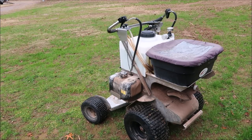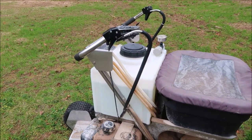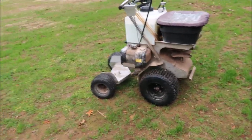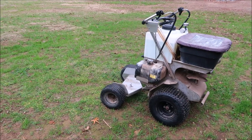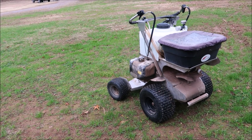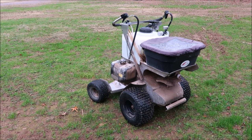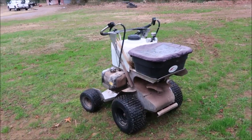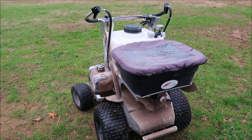I'll use my spray tank when I'm blanketing the yard with a pre-emergent or post-emergent application. This one not having agitation is going to be a little bit more difficult to keep stuff mixed up properly when you're mixing multiple products in the tank. There are other machines out there — Ferris just came out with a new one, Scag came out with a new ride-on spreader sprayer, you've got the X-Mark machine, Steel Green, and the Z-Spray that X-Mark acquired. Those options are going to have agitation in the tank. I like this one because it's rackable — it's smaller, it can fit through a 36-inch gate, and with me using it mostly for granular, I didn't want to pull a trailer. Being able to put it on the rack on the back of my truck makes it really convenient.